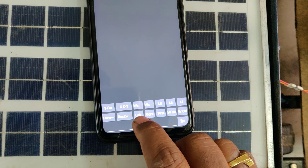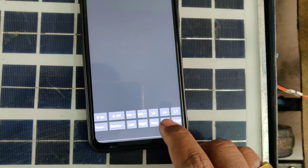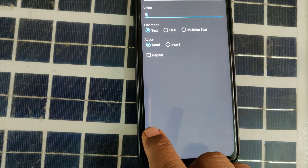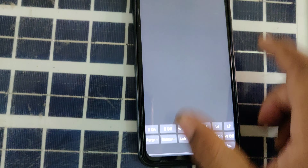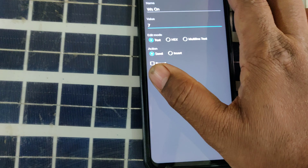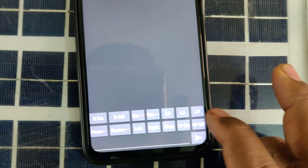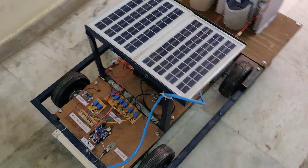Configure forward, backward, left, right, and stop — using F, B, L, R commands. You can see these icons. Next, water off for motor 2, then 'S on' is for seeds on with value 5, 'S off' for seeds off with value 6. 'WS on' is for pesticide sprayer — that is 7 — and 'WS off' for pesticide sprayer off is 8. The remaining buttons can be left empty. After successfully configuring all this, we can switch on the power supply to the robotic vehicle.